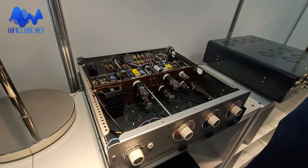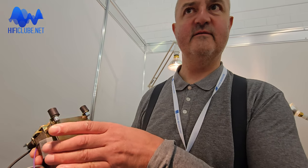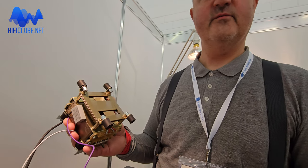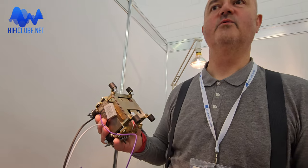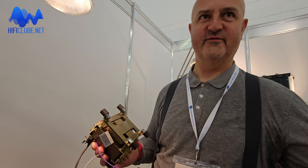This is an in-house made power transformer for this amplifier, and in the finished product it sits right here. I do all transformers in my electronics myself, which includes the winding process, assembly, and the baking with resin process as well. The transformers are very quiet — that's why I make them myself. The same holds for all mains transformers, chokes, and especially the most crucial part: the output transformers.